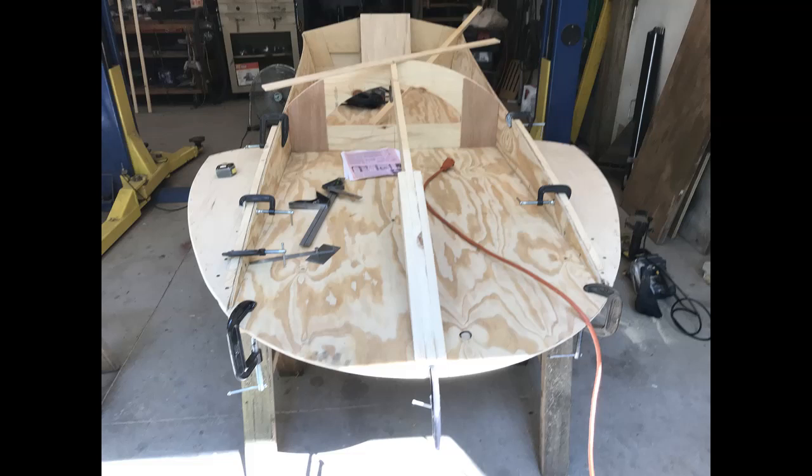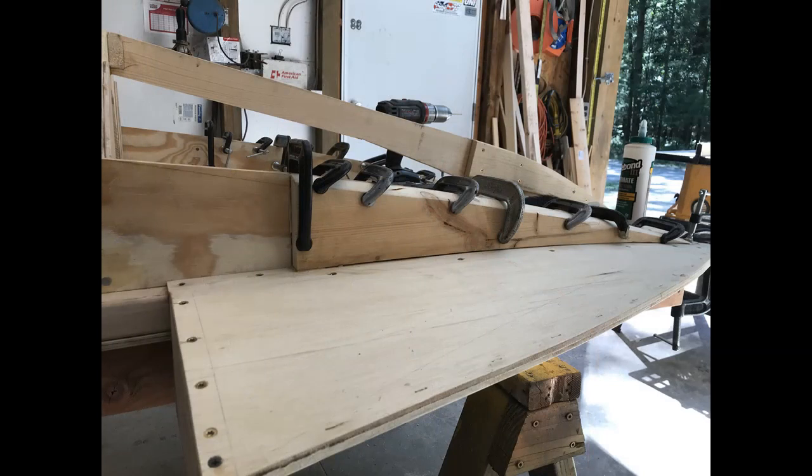Other than that modification, it's following the plans, getting it in place, and then moving on to the next cover piece. Here's a better view of the supports I was speaking of — I brought that back farther to give it some strength. You'll also notice it has to be beveled to match the top bow piece, a quarter-inch piece of plywood, and that will have to be fit each way as it goes. It's an on-and-off kind of fitting process, like normal.